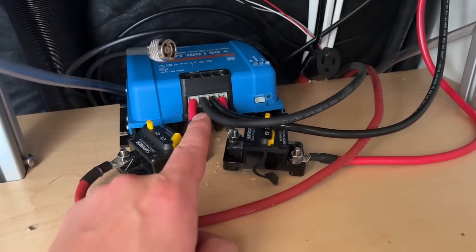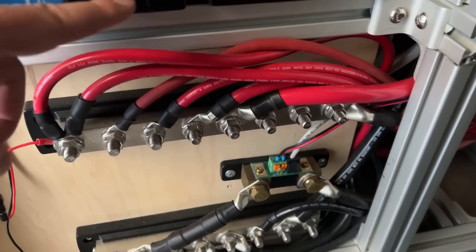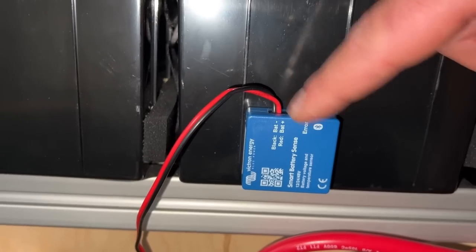We have the four wires going in and out of our solar controller. That was a little bit of a sweaty endeavor — it's starting to get hot out here in Tahoe — but we did finish the wiring. This right here is the positive from the solar controller, which goes up to our on/off switch for the solar panels. Then on the other side of the switch the wire comes down and attaches to the positive bus bar, basically attaching directly to the battery bank. Our ground wire, instead of going to a switch, comes directly to the negative bus bar of our battery system.